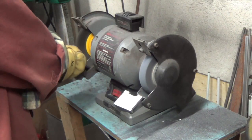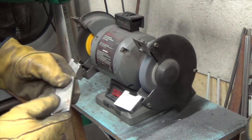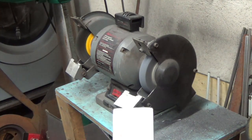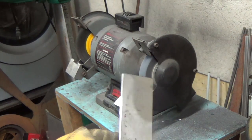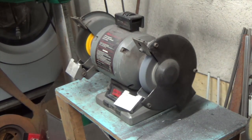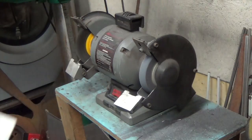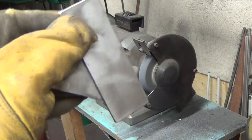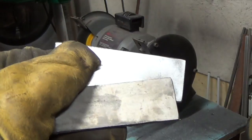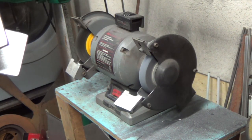I'm gonna put a wire wheel on this side. And then, before I call it done, even though the mill scale is gone, I'm removing, I don't know if I'm in frame. There I am. I'm removing whatever is left on this flat surface. I'm not sure what that is, but I'm taking the wire wheel and taking it all off of there. So that when I'm done, the pieces look like this. Nice and shiny, as opposed to when I started. Dull, and I'm not sure what that white surface is, this dull surface. But anyway, I'm removing it before we move forward. So we'll come back when I'm done with this part of the work.